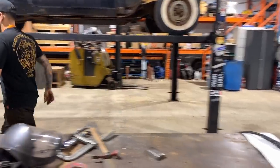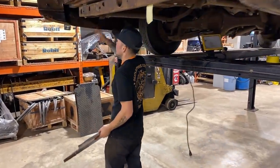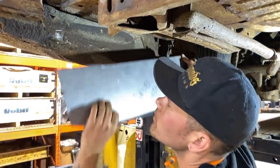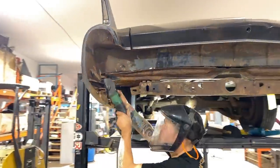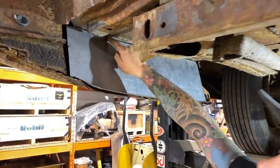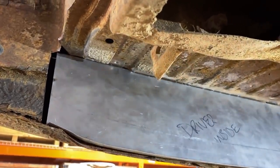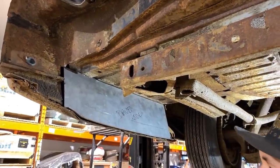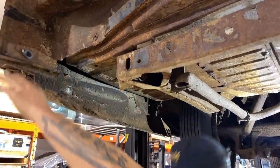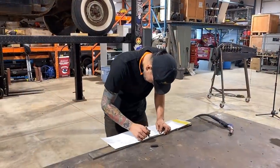One more quick shrink. There's going to be a little bit of fitting to do. This is the side that's going to get a whole new bottom lip so I'm not worried about this bottom edge right now. You do have to trim a little bit of that out. There you go — it's a lot of work for a little step, but if you want to do it without cutting and welding the way the factory does it, you can do it with hammer forming. Once we remove that junk, it should be able to clamp all nice and tight.